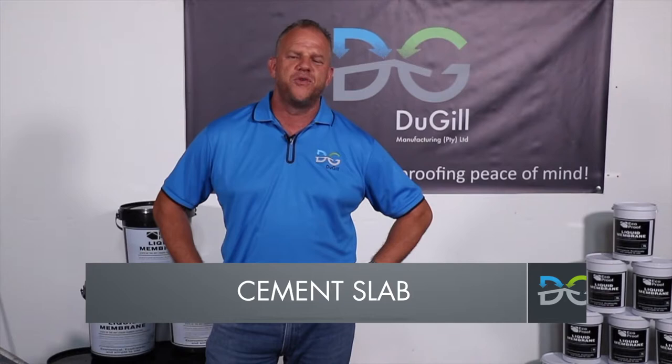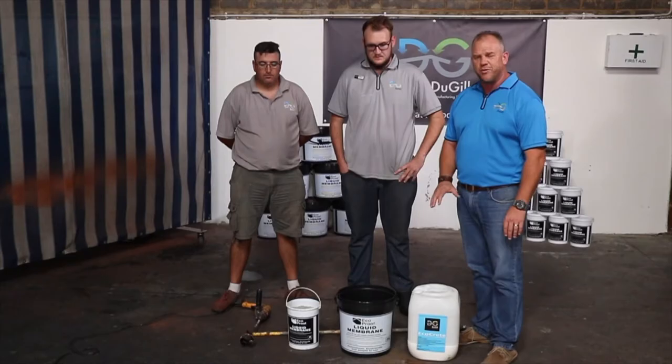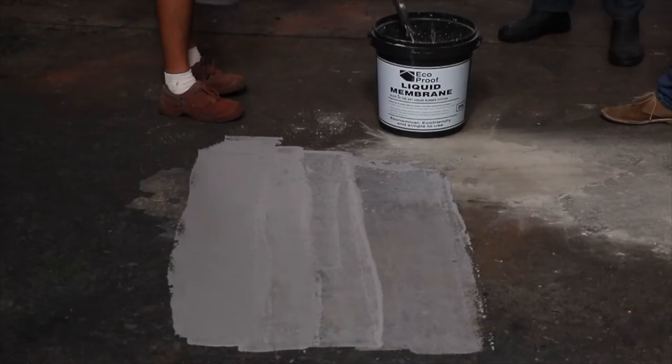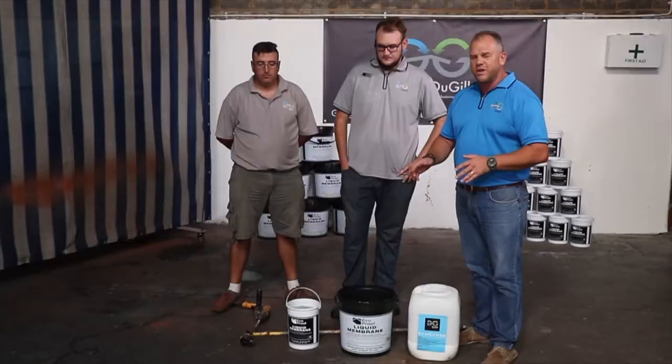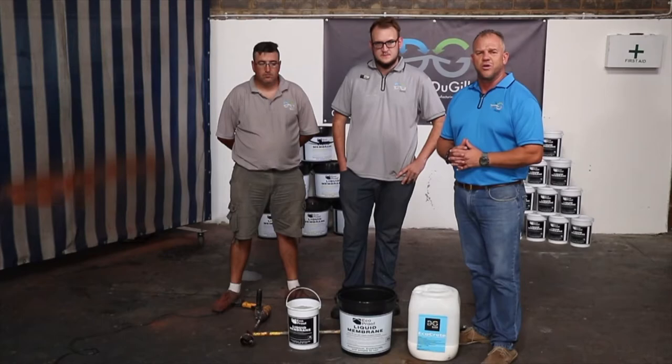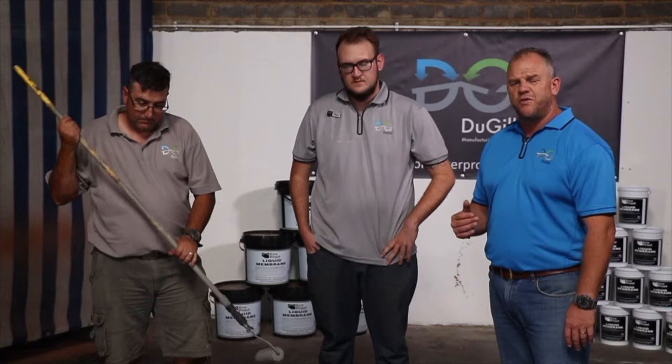I'm going to show you how to waterproof and seal a cement slab with our products and also to avoid any problems going forward. First of all the slab must always be clean — you can rinse it off with water. If there are any structural cracks, please attend to those first before applying our products. EcoCrete has got three functions: it works as a moisture barrier, it will suck out any moisture that's in your slab, and it will give your surface a nice clean area to work on when you apply the EcoCoat on top of it. If you want it a little bit thicker you can add some more cement, but our recommendation is one-to-one. You can't spray this product so use a brush or a roller. Once you apply the EcoCoat on top of the slab you must leave it for at least 24 hours, so the next day you will apply your final coat.